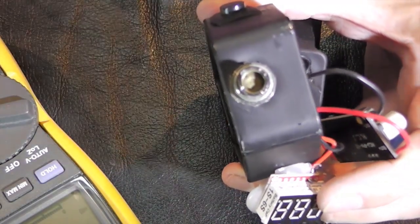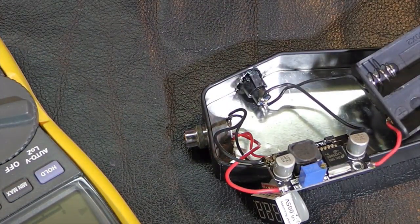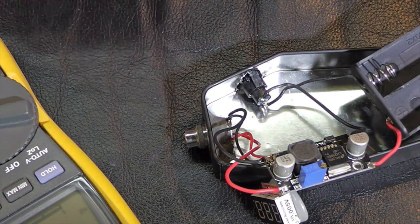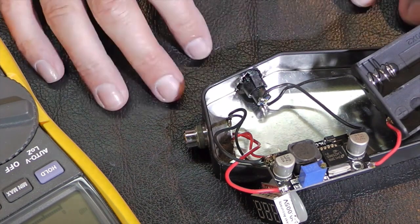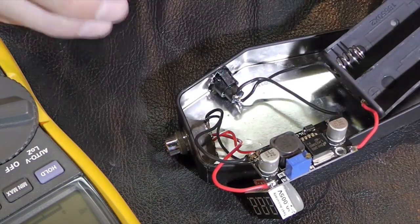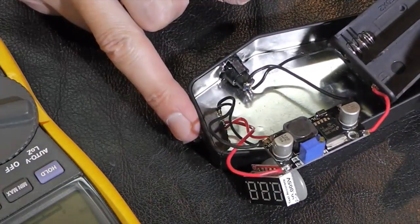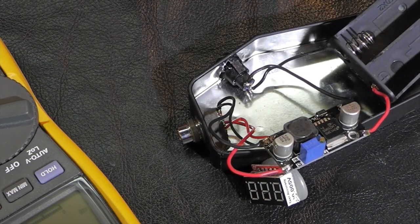It's not going to focus. Extract the centre, put a new rubber in, and seal it back up again. But we'll go through that again. Common failure point. Horrible bloody things. They need to be rethought, redesigned. Wasn't expecting that. Like I say, when you're looking at a mod, although this component has failed, the switch works, the batteries are working, we've got our display, I could have put all that together, screwed it on, had a dead short, and it wouldn't have worked. Always test your rubber. If your rubber is blown, you've got problems. I'll be back in two.